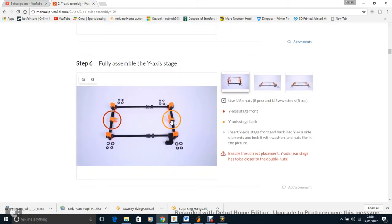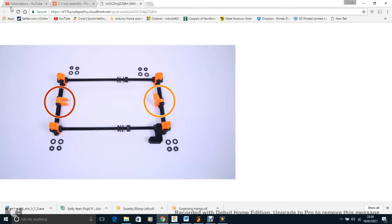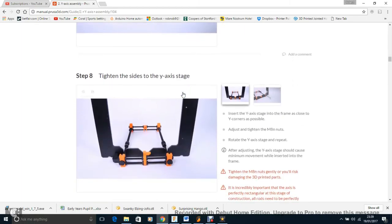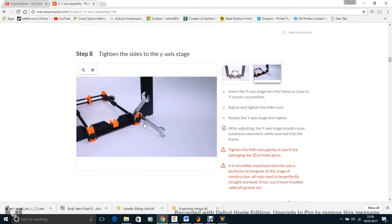You can see one mount is completely opposite the other. You want the idler bit in the centre. Steps seven and eight just show you the idler on one side and the motor mount on the other — this is just to get the frame square, you're not putting them in final position yet. They should slot in without too much difficulty. If the frame is a bit of a parallelogram, just adjust the nuts to get it as straight as possible. For the rods, you have short, medium, and long ones — just put them next to each other to identify the medium ones without measuring.